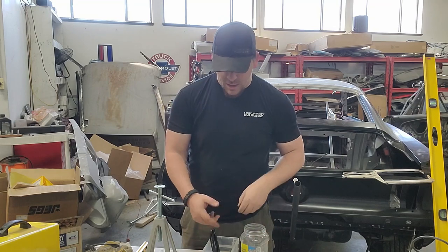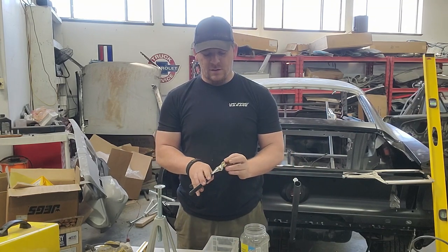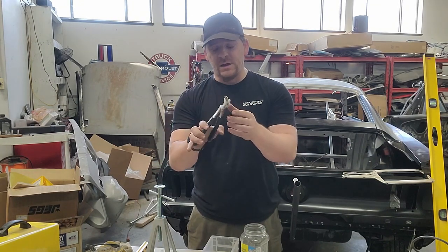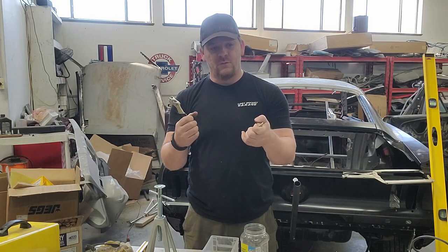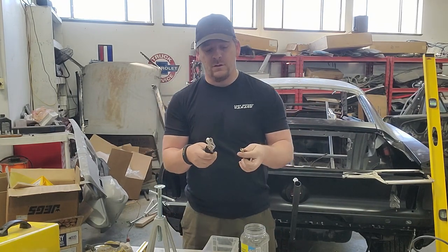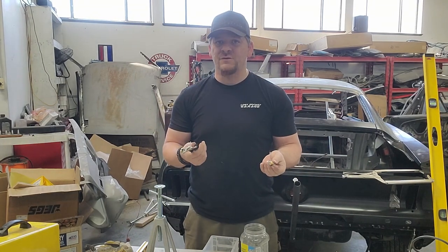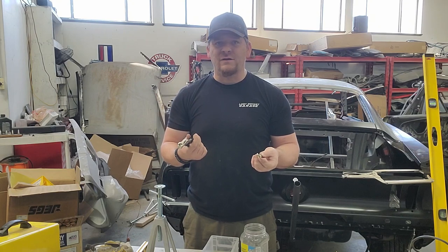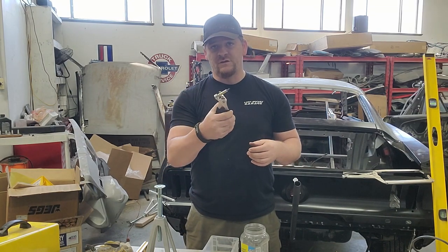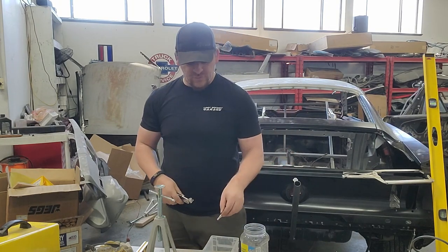Self-tappers are great. Another thing that we discovered, well, we're not Columbus, but Clecos. We do love Clecos here because they're wonderful for the inner structure as well as putting the outer skin on the car. They'll come with a wrench. You can get these off Amazon. They're like $70 for 70 to 100 pieces. These Clecos are awesome for any metal work that you do.